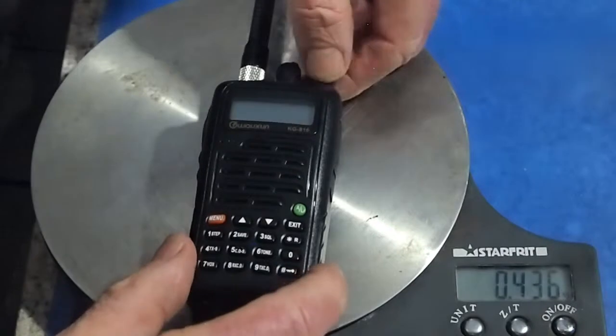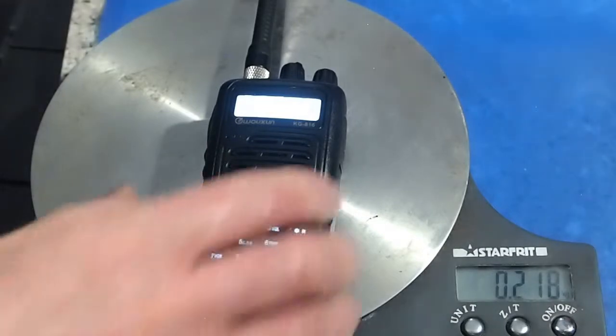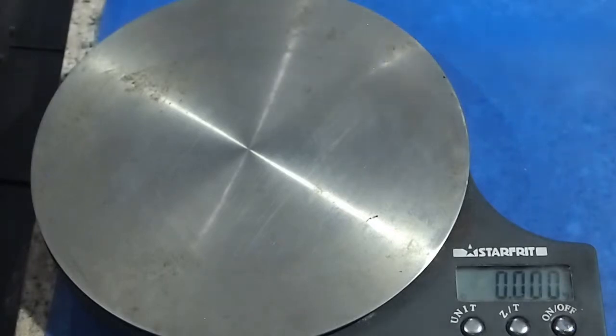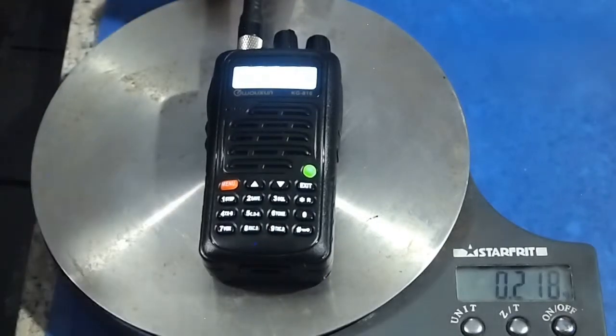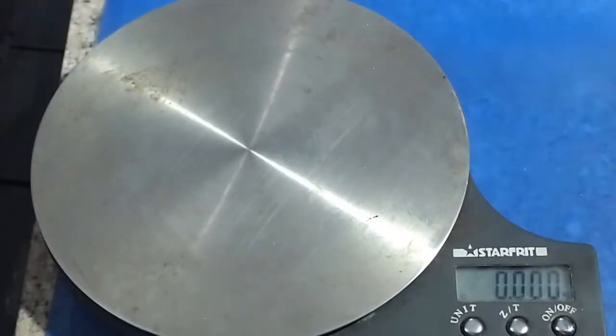With this pack, you'll see it's coming in at 8 volts. When we use the standard lithium ion pack with a full charge, it also comes in at 8 volts. At 600 milliamps you won't last as long, but in testing with the FM radio running full-time, I've been able to get between 4 to 6 hours with the AAA cell pack.